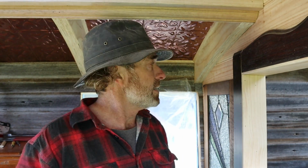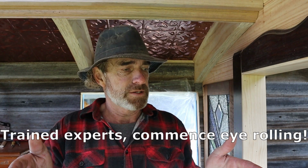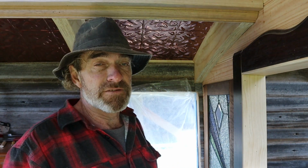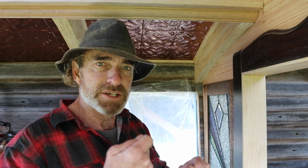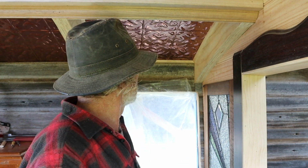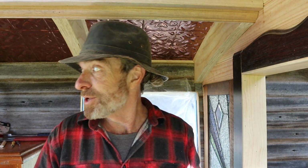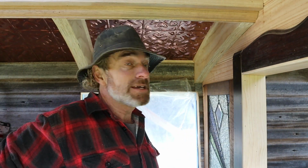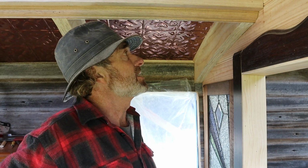I found a quicker way to tackle this. I cut my 45s, but I also cut them on a bevel, like a 5-degree bevel, which takes away more of the back, thus giving me less to carve away for when I pretty much carve the shape to meet the other quad. And that kind of works. Must remember, I'm not an expert. It's all trial and error with me. But persistence is key. Spend enough time on something long enough and you get it right eventually.